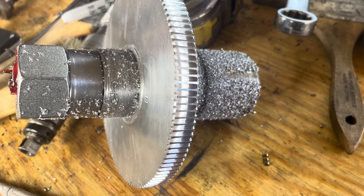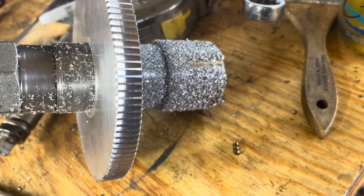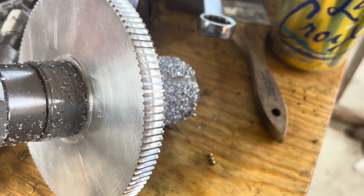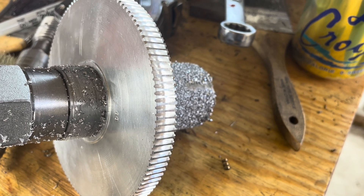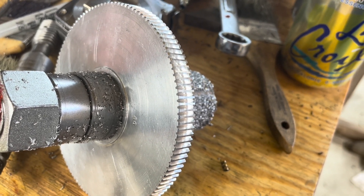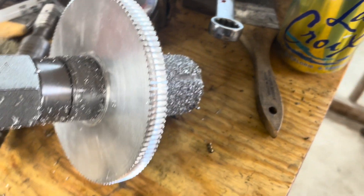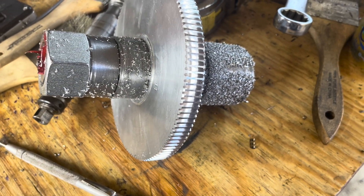What I'll do is make a worm that's just a slight bit smaller diameter than the hob I used, which I'm told produces a crowning effect, so you get more of a contact pattern in the center of the worm gear. Anyway, this was pretty good - this is the highest tooth count I've made on my machine, and I have to say it doesn't look like I missed any teeth, so good deal.